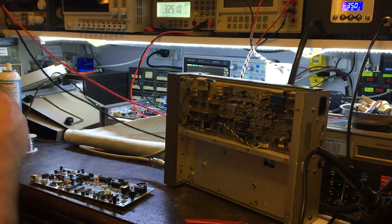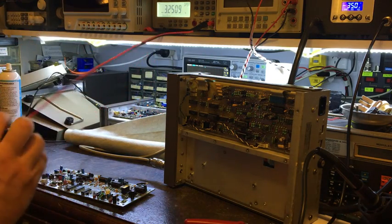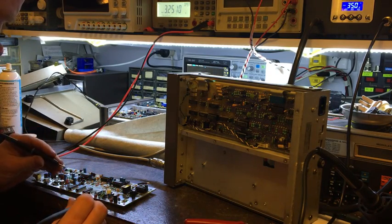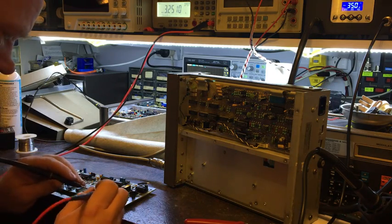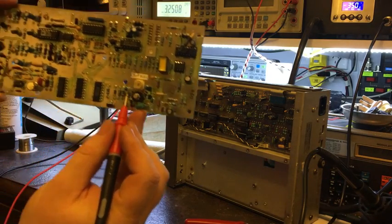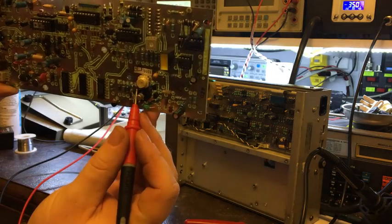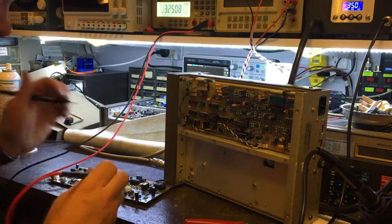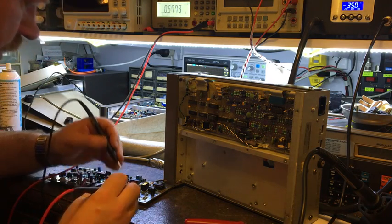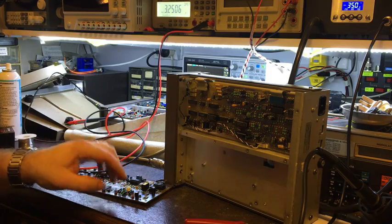I've discovered a little problem. This is the RF board from one of the Boontons I'd already repaired. It was working and then it failed again when I was doing some comparison testing with the other unit. I may have accidentally bridged across the oscillator and blown some stuff up. I was trying to trace it and it's got two diodes on here — CR13 and CR8. I desoldered one and that's shorted, and so is the other one. I had to desolder the inductor originally trying to diagnose it, and those two diodes are blown.